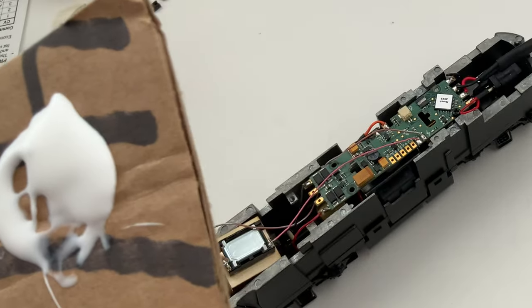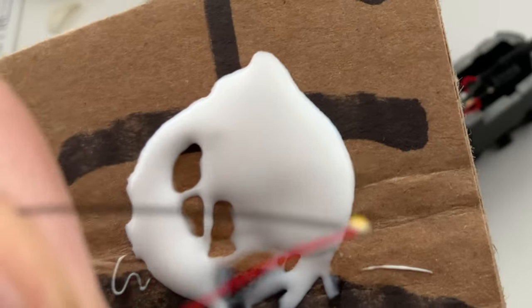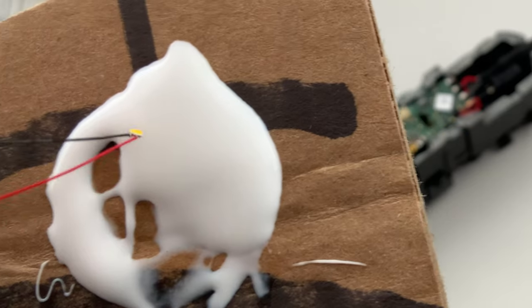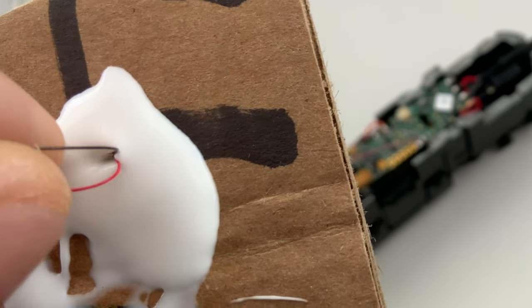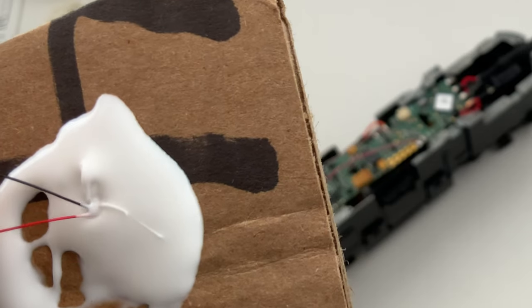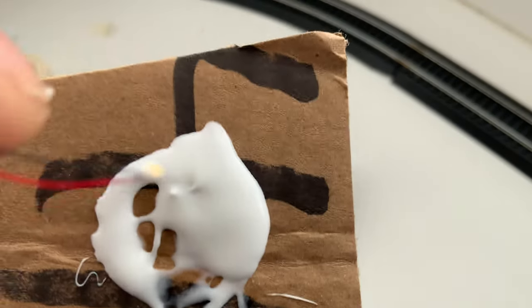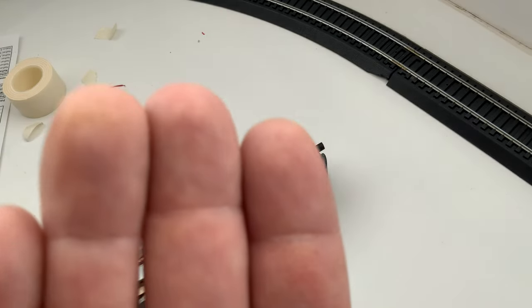One of the reasons I like to do that is because, again, these are really fragile, and putting glue on there allows them to hold quite a bit better. But on top of that, those contacts are actually exposed on the back of this SMD LED, and if you accidentally short them, you'll blow the whole thing out. Well, you could blow them out, I should say, but if you short them, it just may not work at all. So I almost always put glue.